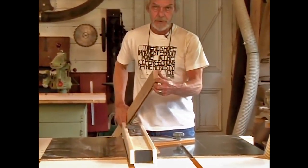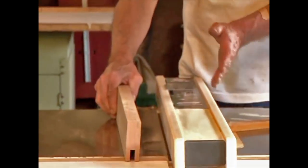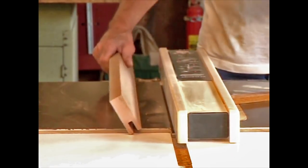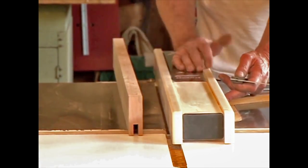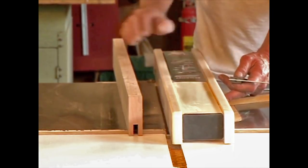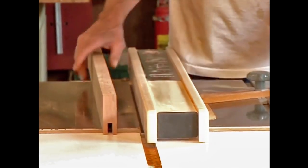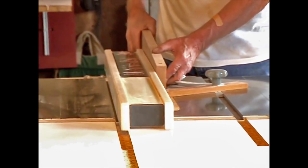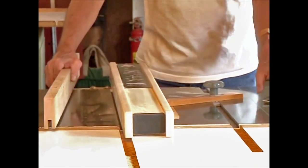We want it exactly centered on the breadboard. So rather than being very careful and measuring from one end to the other — the groove, by the way, is 3/8 of an inch — what I do is use two dado blades which are a quarter of an inch. How we get it to 3/8 is run it twice over the blades from one direction and turn it around, run it from the other direction so it's exactly centered. You take off the same on each side, in this case 5/16.